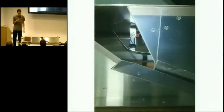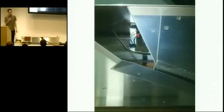Another way that we avoid problems and detect duplicate pages or missing pages is with a sensor that's right inside the machine. As soon as a page comes in the slot to be turned, there's a break beam sensor. So we detect exactly when the page arrives. And basically, if a page arrives at the wrong time or doesn't show up, then we know that something's wrong and the motor stops. So this sensor is connected directly to the motor, and that's part of that microcontroller program.